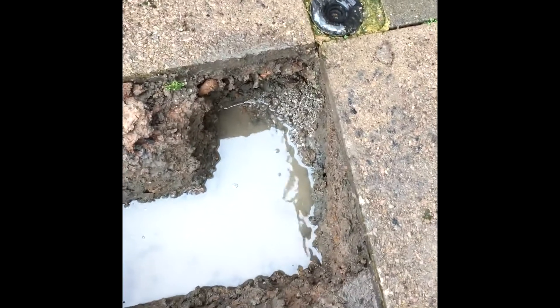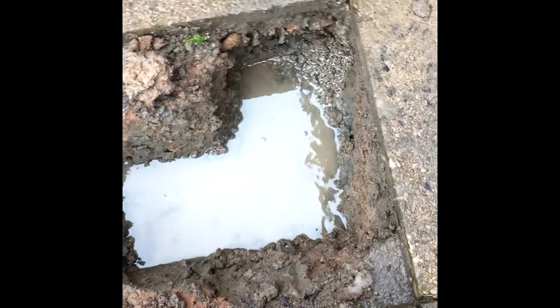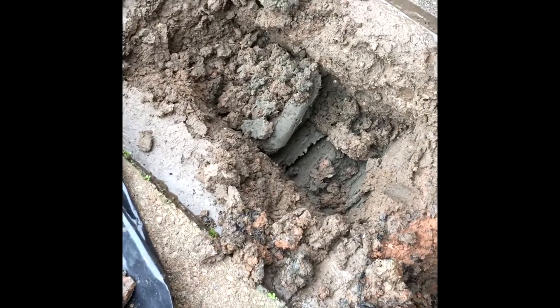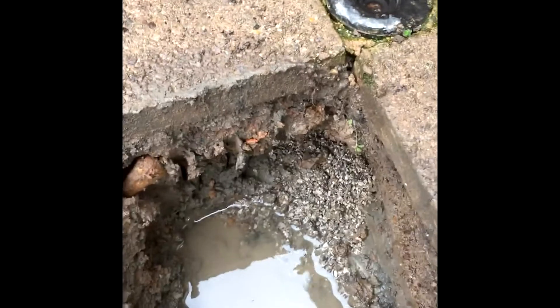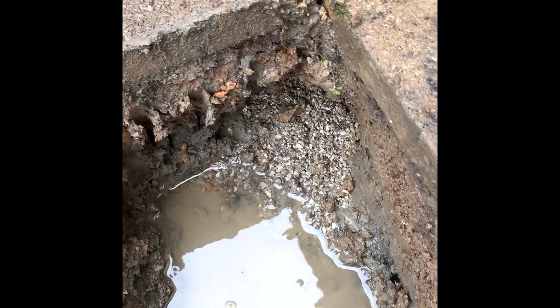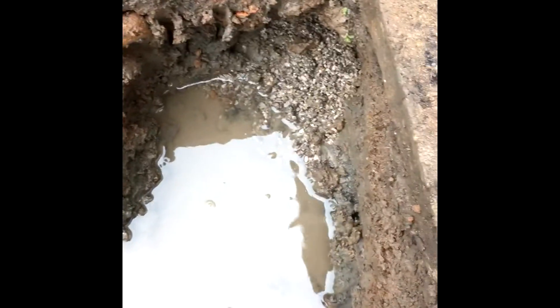Next to where they're draining the water away, there's a hole that hasn't had the water yet, and suddenly there's a lot of water in this one coming from the bottom where it was in the clay. To fix this, I'm going to put some drainage pipes to some sort of soakaway or towards the grass, and that should stop the problem.